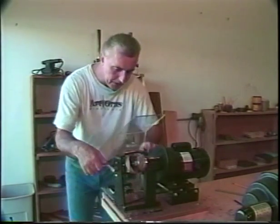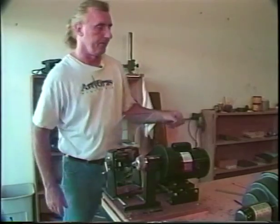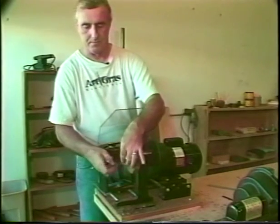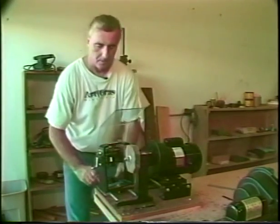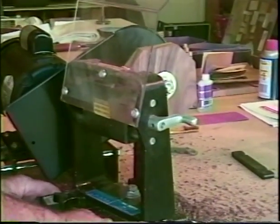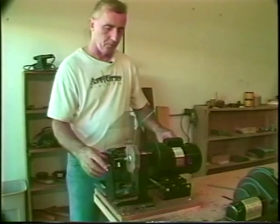Let that fall off to the side, center your blades, pull back your slide plate. This ring here is going to be for the very top of the vase, so we'll put that aside for a second. We're on to our third block — keeping the lines to the outside, mounted with the washer and nut on. This one we're going to cut two rings, both at the same 19 and a half degrees. Slide the slide plate forward until the left hand blade is just inside the stock of the wood, find the next hole for the index pin on the index plate, tighten it, and we're ready to start our cuts again. Turn the machine on.